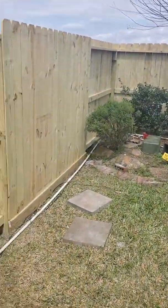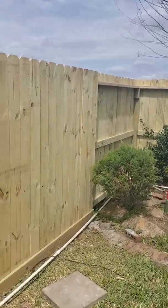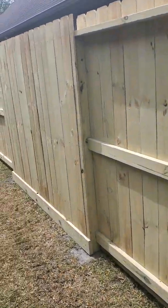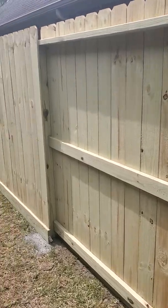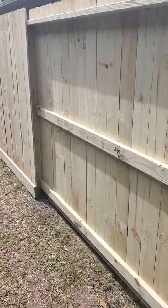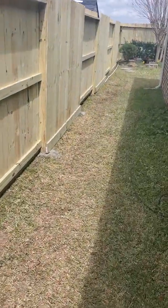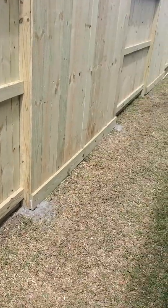And then you should pressure wash your fence once a year. Wash off all that old weathering, wash off that old water seal, and reseal it. Because after about 12 months, that water seal starts fading and it stops protecting. Unless you get a really good quality one that might extend the life of the fence. Maybe you could pay more money and get one that might last 3 years, something like that. That's kind of the way I look at a fence. It's like a car, like I said. This is the motor. Those pickets is just the paint job.